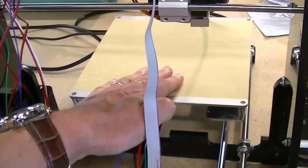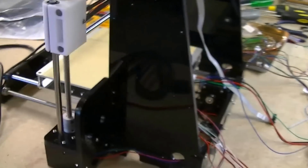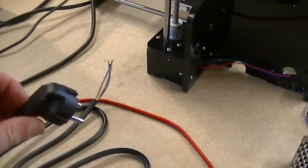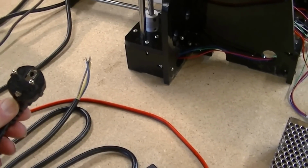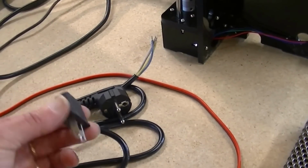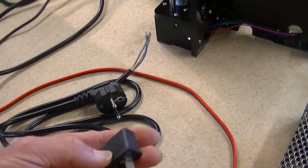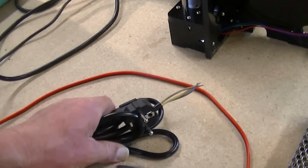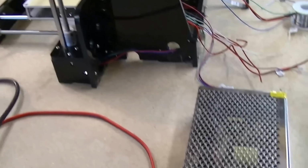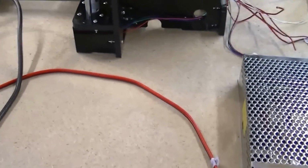There's a couple more serious problems, which are health issues, I would say. This mains, 240, 110 volt, depending on where you live. The lead that is supplied with the unit has an adapter plug for Australia and probably other countries. Do yourself a favour and chuck it in the bin, because it doesn't have an earth. This machine definitely needs earthing.